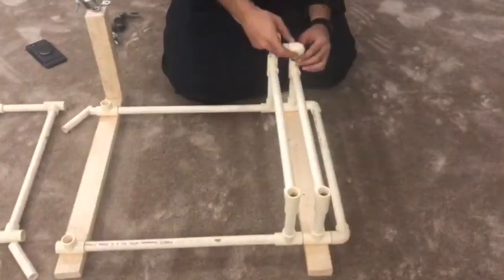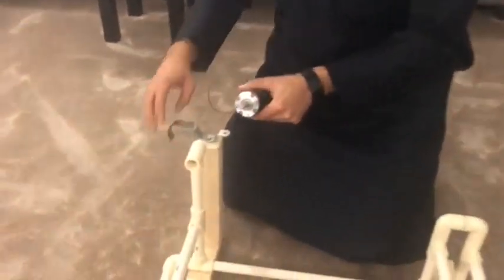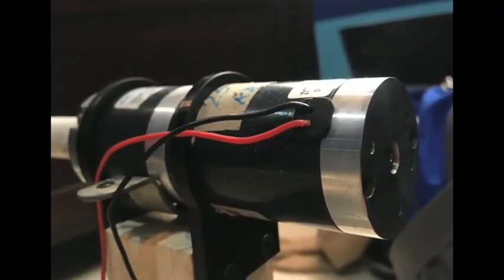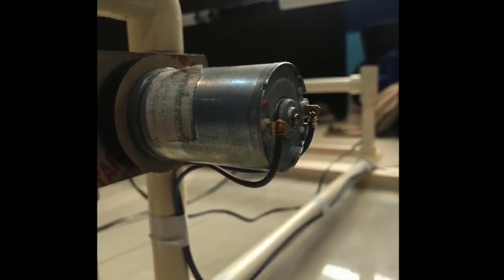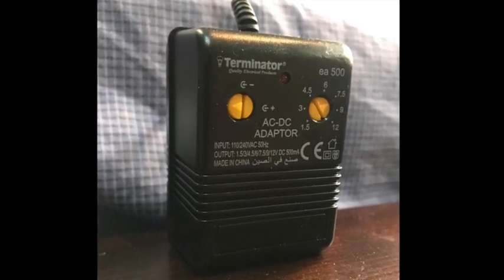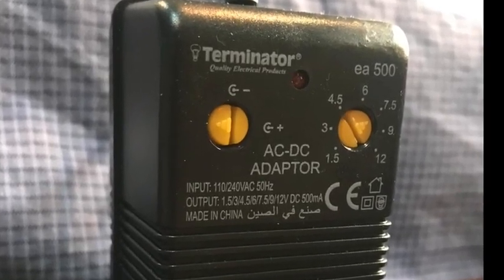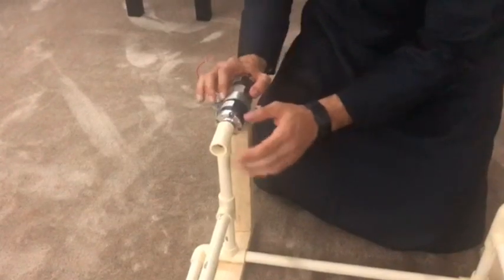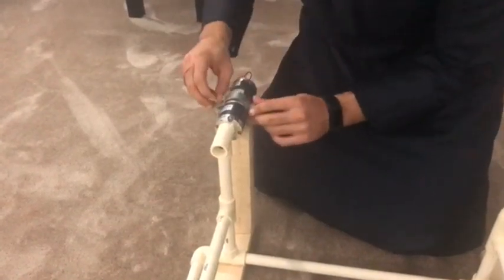while the motors are working. The second failure that happened was that when we adjusted two motors, one was moving very slow and the other one was extremely fast. Therefore, we had to adjust both motors to have the same output voltage. From a professional point of view, he helped us and said to take a transmitter and link both motors to that transmitter so that the output voltage will be the same and the speed will be slow so that the thread could wind up the pipe.